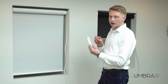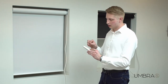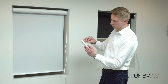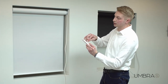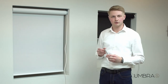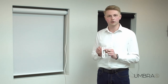At this point, I need to press and hold the programming button until it shunts twice. As soon as I press the programming button, it will do one shunt, but I must keep holding it until it does the second shunt — otherwise the reset procedure won't be complete. There's the first shunt; keep holding until it does a second shunt. There's the second shunt. At this point, the motor is completely back to factory settings. There are no limits set and it's not paired to any remote controls — as you can see, I can't control it anymore.